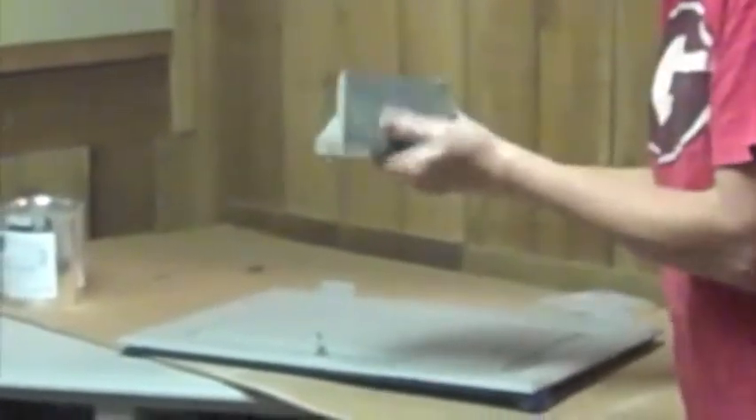You can just sand right over it. Now I'm going to take my sanding pad — this is probably a 150 to 180, and this is a 220 — and you can find these kinds of pads at Lowe's, Home Depot, whatever home improvement store you like.